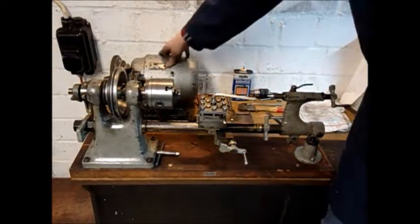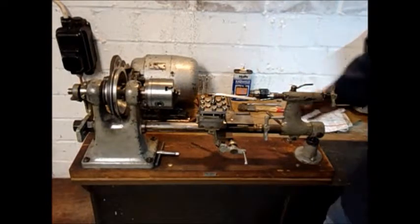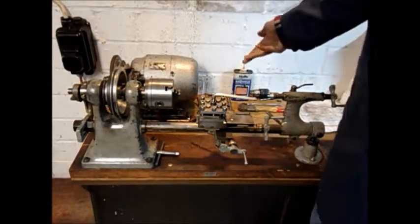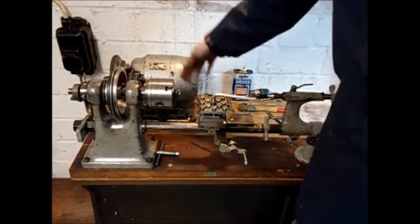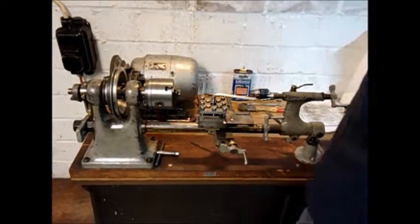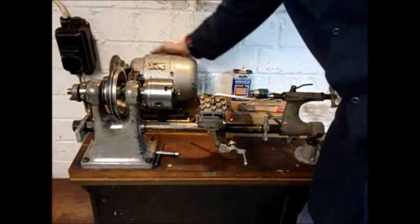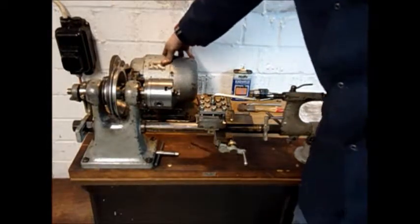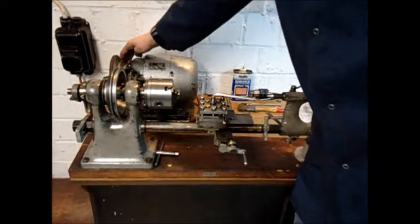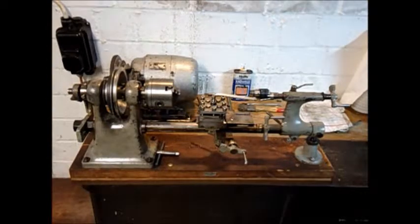I also changed the way to tension the belt here. Before, I always put a wedge in between the two board sections. That's not possible right now, so I put two hinges on the motor on the bottom. And like with the three-pulley drill presses, you can now put down with two screws at the back to tension this motor. This is a floating pulley — it's loose — and then you can tension both belts simultaneously. That works pretty well.